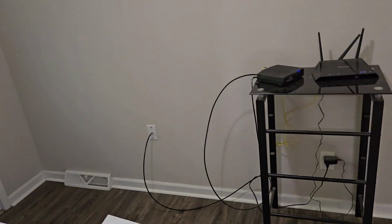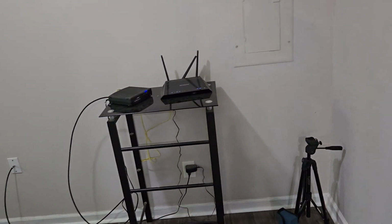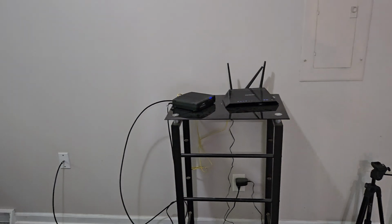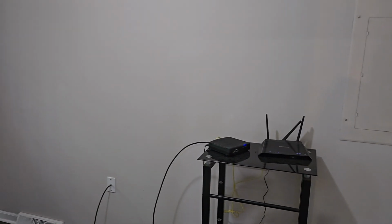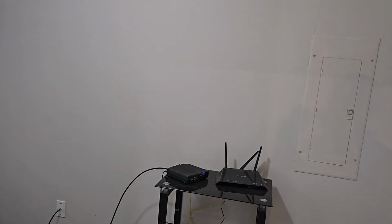Those fillers can be cut down on site to be that exact size or as needed. So with that being said, another note for the electrician is that along this wall, since we are going to have a new countertop here, we do want a couple of convenience outlets. Looking at the length of this wall, I leave the number of outlets up to you. However, it is suggested, or it was desired, at least 3 outlets. 1 outlet, 2 outlets, 3 outlets along this wall should be a good amount.